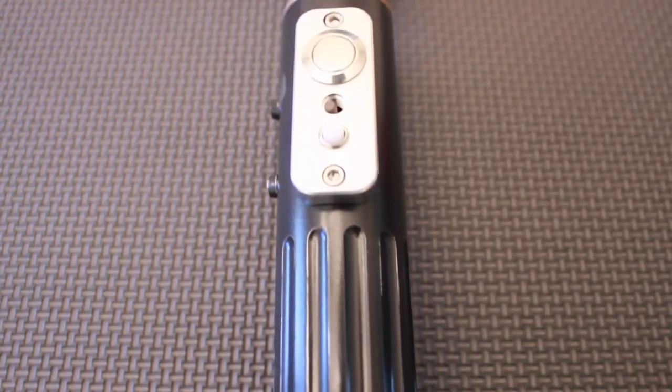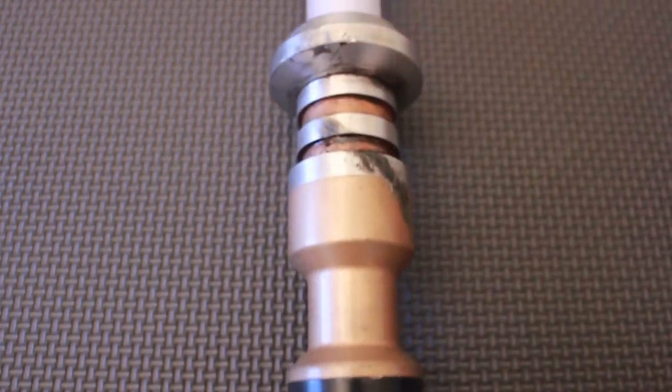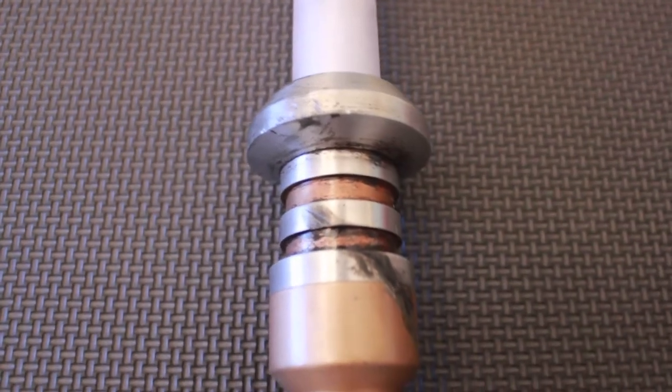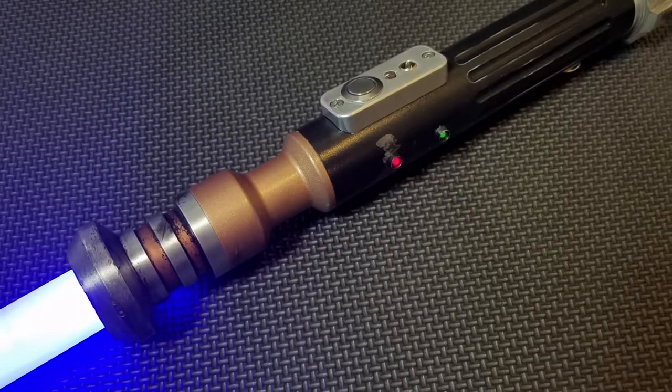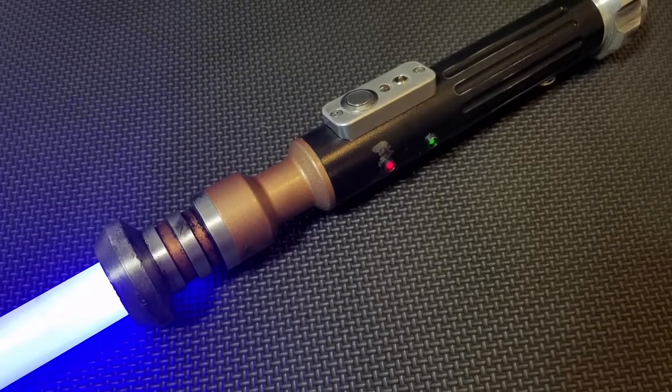This is hand painted — not powder coated. We did sand this stuff down, cleaned it, and hit it with a really good self-etching primer. A few coats of that, allowed it to dry properly, sanded it again, and then painted it. Weathered it and sealed it.